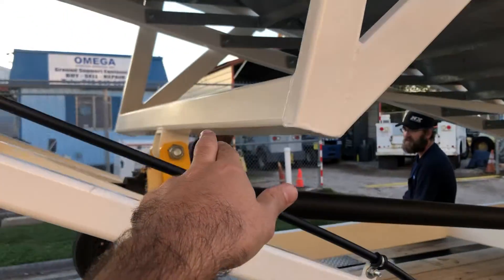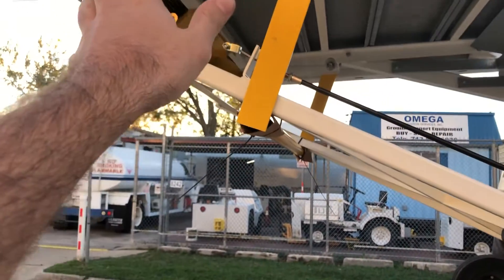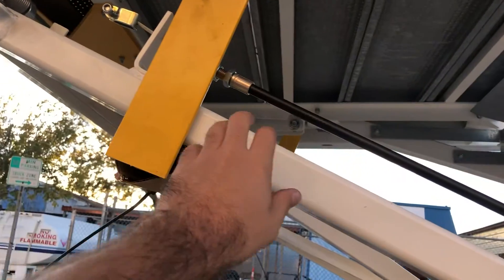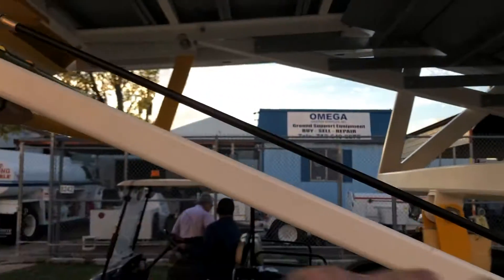Once you've secured this hydraulic cylinder up onto the frame over here, lift up this A-frame to match it over there, lifting as needed to get the A-frame into these holes using those new nuts.